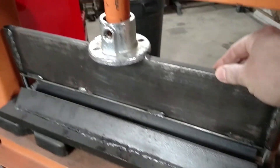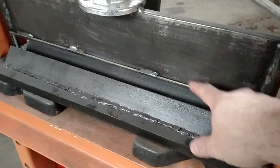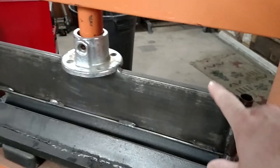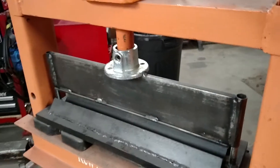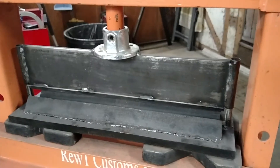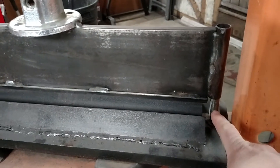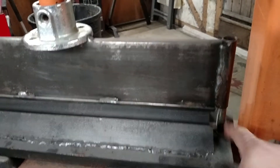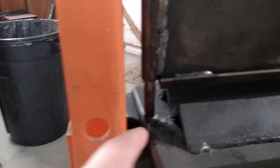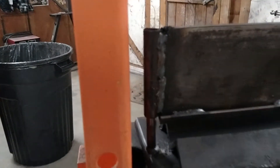The top plate is a ½ inch plate with ¾ by ¾ or ½ by ½ angle iron welded to it. You can take a grinder and grind it down to form a point, but I just welded that on there and it has worked fine — welded on the front and the back. Then I just welded these pieces of tubing to the side and then square solid stock tube right there that fits inside of this. It is welded here, drilled through half, welded on the bottom, and ground flat.